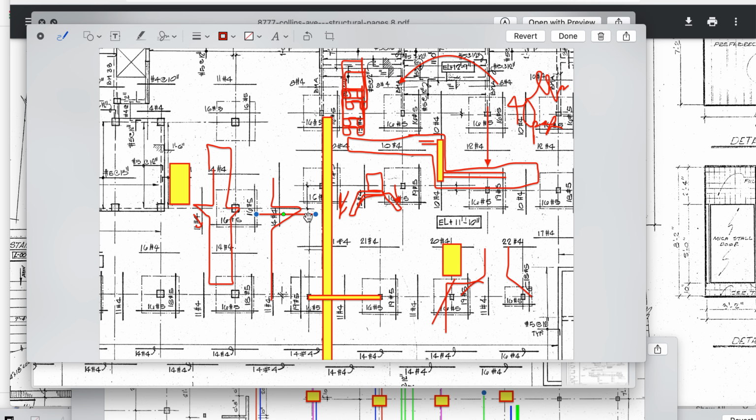But over the years, the deck has cycled. They covered it over with a concrete layer so they can't see it, the concrete layer being stamped concrete all out here. And on this side, so you can't observe the deck, they put, that wasn't their intent, but maybe it was, so they didn't have to look at the cracks. Perhaps there were cracks beforehand. They put a pavered system over top with more concrete. It seems like the concrete exceeded the original designer's 40 pounds per square foot design.